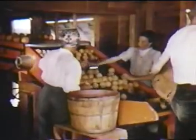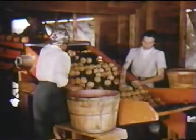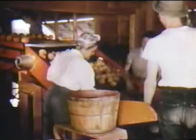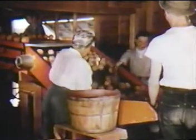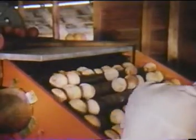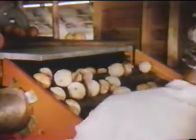First, they are carefully emptied onto a rubber-covered roller conveyor, which will carry them through a brushing machine to remove the unpalatable fuzz, nature's protective covering. The rollers turn the peaches so that all sides of them can be seen by the graders, who throw out any bruised or blemished peaches. In the defuzzer, the peaches are pressed against revolving brushes with bristles nearly as soft as the fuzz itself, so the skin of the peaches will not be damaged.